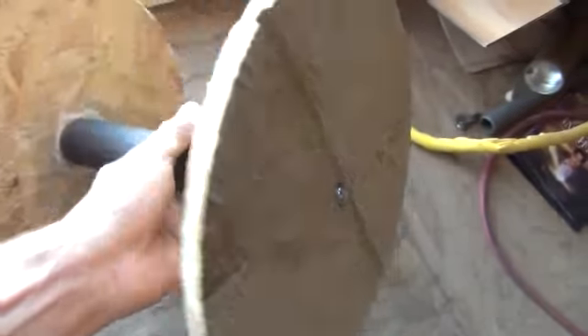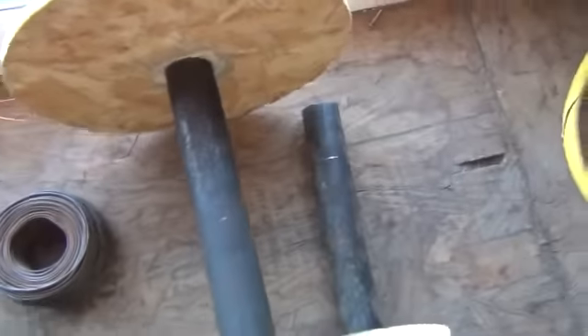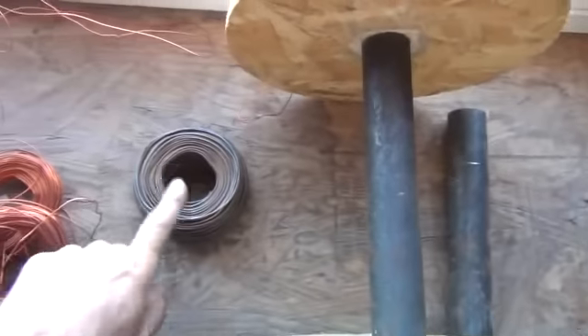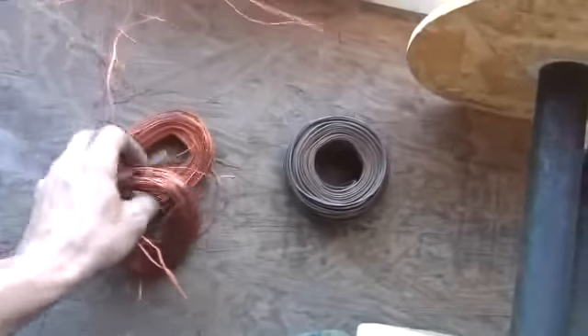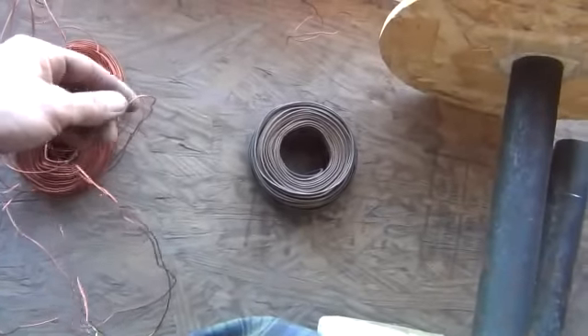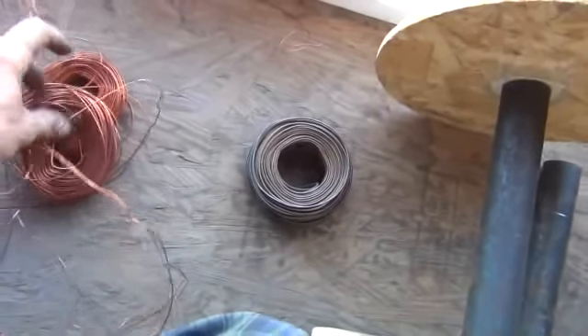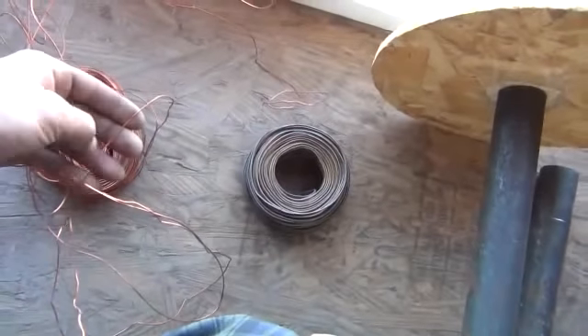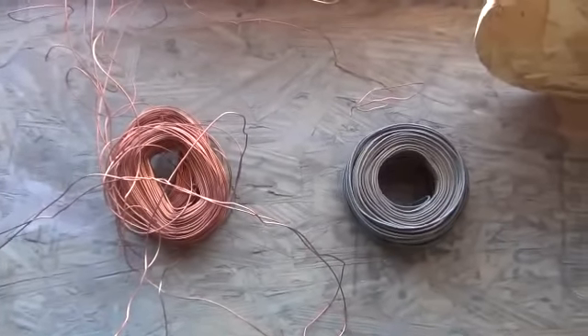Right now I've got one of those iron rods. Looks like a wire spool basically. You've got end caps made of an insulative material like wood — works pretty well. I've got that bolted on with some bolts through into the iron in the center. What we're going to do now is add an insulative layer, which I'll show you in a second. We're going to wrap a coil around this with a combination side by side of iron wire and copper magnet wire. I have a couple exploded coils from an old project that I can use. It says it can have an insulator on it, so I'm going to put the copper magnet wire on there with its little insulative cover — we'll see if that still works. Some of the older designs had cloth-covered exposed copper, which allows moisture to still go through. But even Stubblefield's design said there can be an insulator on that, so we're going to give that a go.